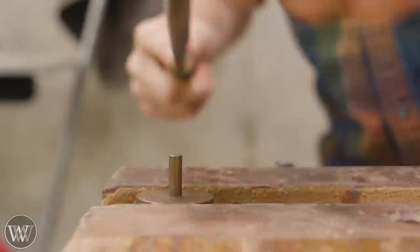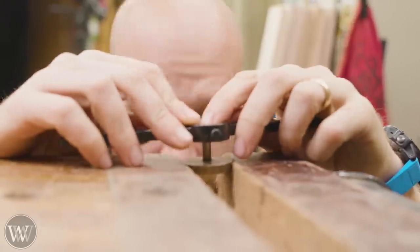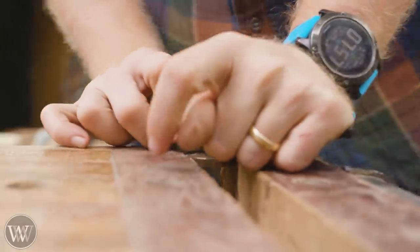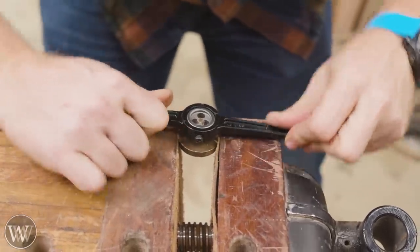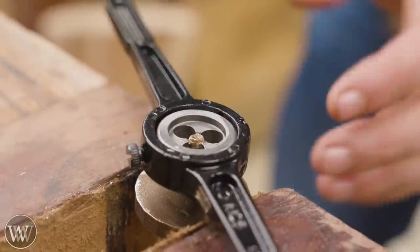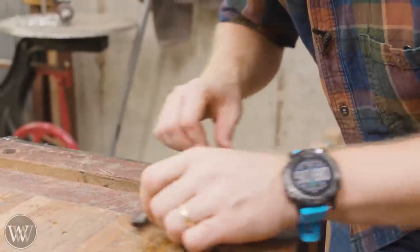On this one I just had to file it off a bit so I can get it started. If you just taper it a little bit, it makes it much easier to get this on there. Good pressure, even placement, and you can start cranking it down. You don't need the threads to go down all the way — just enough that it holds on well. Lubricate the threads so it's working in there, and eventually you will have a bolt sticking out of the back of this.